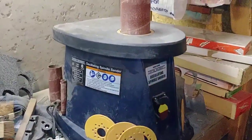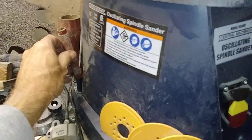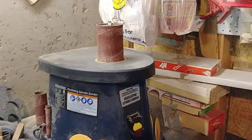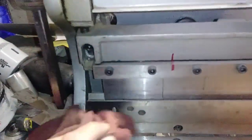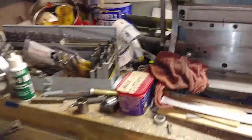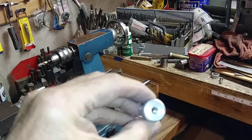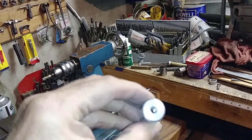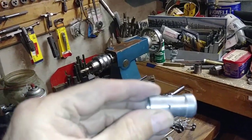And then this here was kind of handy, and I didn't have it when I built the Ultra Cruiser. It's from Harbor Freight. There's the smallest drum, and I think that's the biggest one in there. It came in pretty handy on the bulkheads and a few other things. And then I call these the rod end bushings that go in the push rods, and they're drilled and tapped for quarter 28 for your heim joints that go in there.